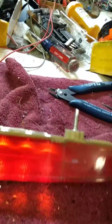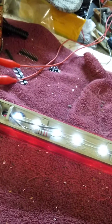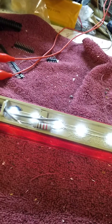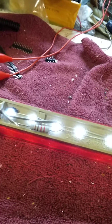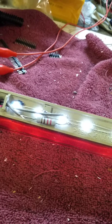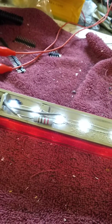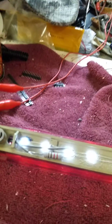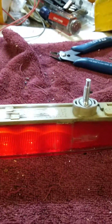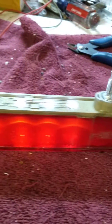I've got it wired up. I just took the diodes and stuffed them in the holes, and I added a resistor. I didn't have a 100 ohm resistor — it needed to be 100 ohm at 2 watts. The closest thing I could find off an old TV board I scavenged was a 220 ohm, probably a 3 watt resistor. That's actually good because it doesn't get near as hot — I can put my finger on it, it's a little warm but not bad.